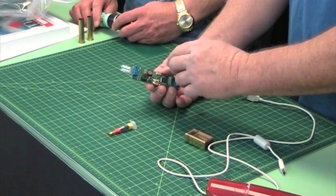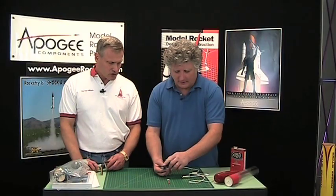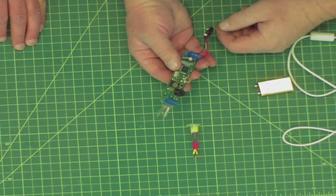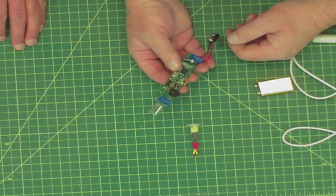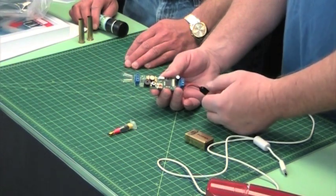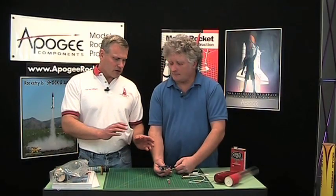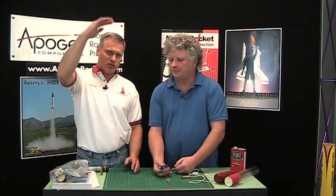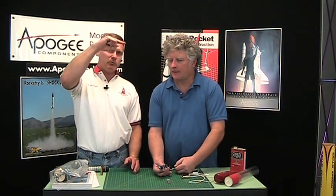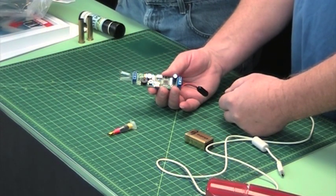On the other end we have a couple of light bulbs hooked up — just for testing purposes — to show that the altimeter is working correctly. You would normally do this kind of test before you fly a rocket to make sure that the altimeter is going to cause deployment at apogee and then at 500 feet. Basically what it does is the altimeter senses the pressure in the air. As you go higher in the atmosphere, the pressure decreases, and then when the rocket starts falling down again, the pressure starts to increase because you're getting lower in the atmosphere. It senses that peak point — that's the apogee point — and at that point the altimeter sends current to an igniter to fire off an ejection charge.